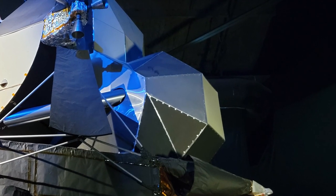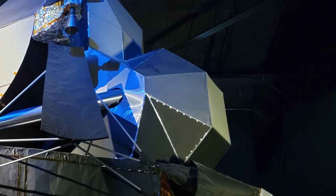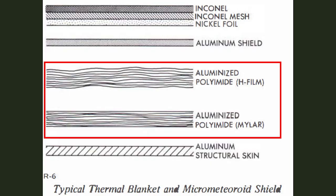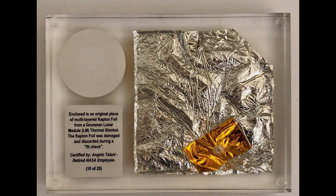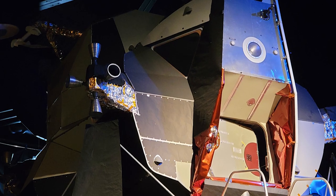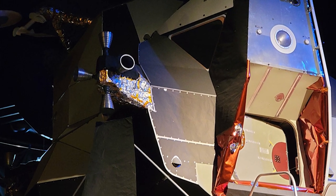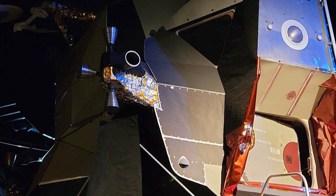This is what created that slightly awkward-looking flat panel spheroid shapes on either side of the lander. The thermal blanket is made up of at least 25 layers of extremely thin mylar or H-film, which are basically plastic films, and each layer is coated with an extremely small amount of aluminum. The sheets are also crinkled by hand to improve the insulation by reducing contact area. Areas that are expected to get extremely hot, such as around the control thrusters, have additional nickel foil and wire mesh present.